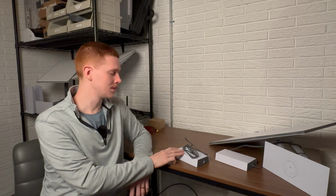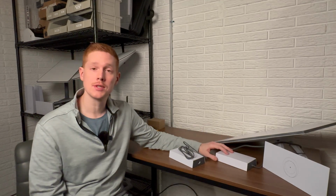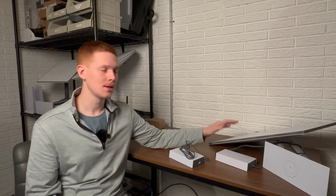All right, so that's the standard DC to DC power supply, but let's put it to the test. The main reason people are going to buy this is they have an off-grid situation. Maybe you have an off-grid cabin, or a vehicle, RV, or van, where your primary power source is your battery system. You could use an inverter and power the standard Starlink dish, no problem. However, many people don't like to use inverters because there are inefficiencies introduced when you go from DC to AC, and then through the Starlink system it goes from AC back to DC to power the dish. That uses up quite a bit of power that's just wasted in the conversion process.